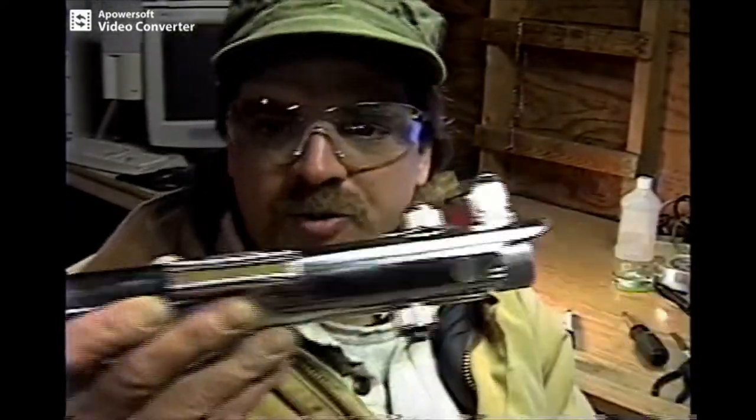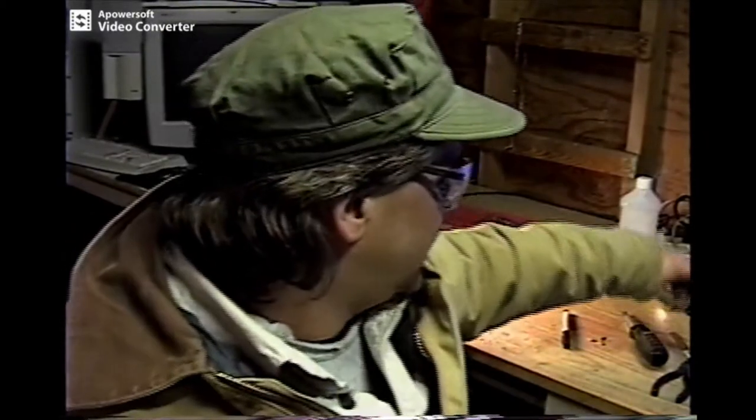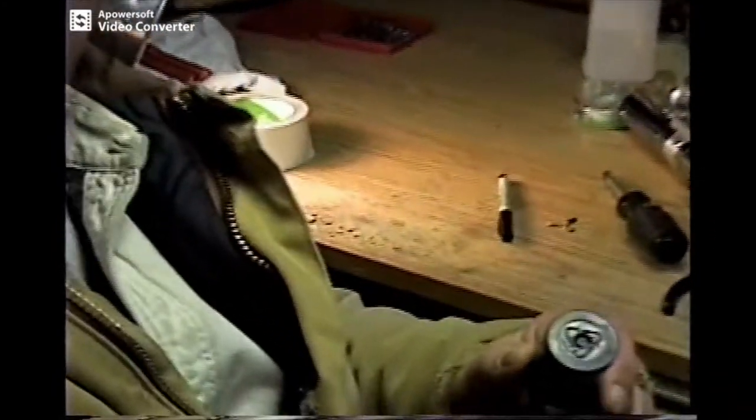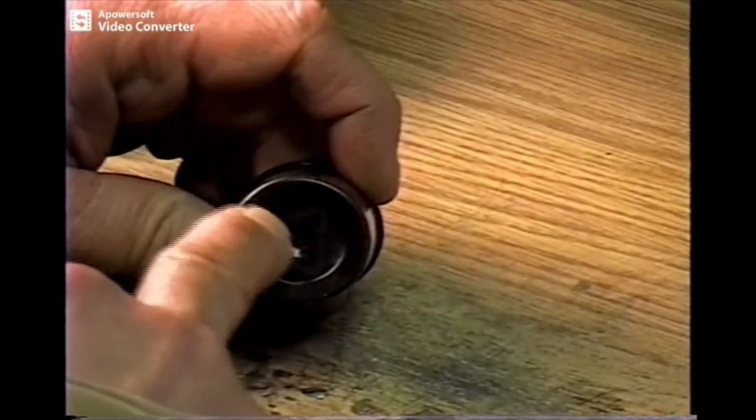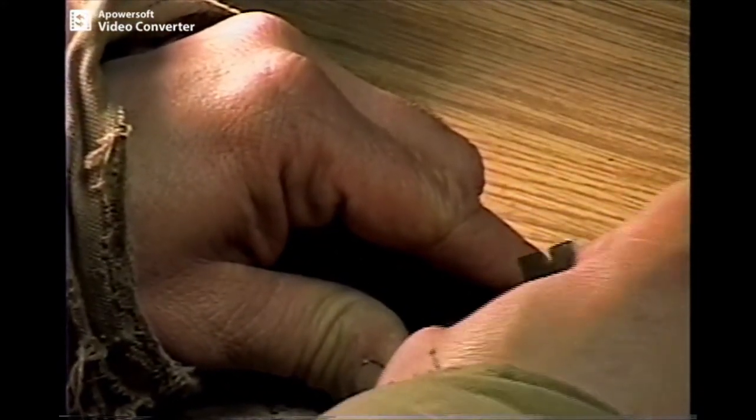Our saber is almost complete. We've got a top red button and a bottom red button. What we're going to do is put our film canister on top. Since the button on the inside is in the way, the film canister will not fit flush all the way down. So what we're going to have to do is cut the film canister just a little bit with a razor blade. I'm going to cut it right on the end — this is so that it can pass the switch.